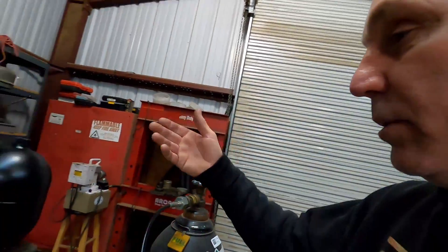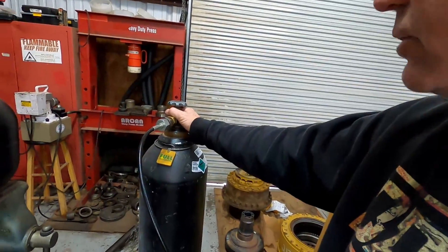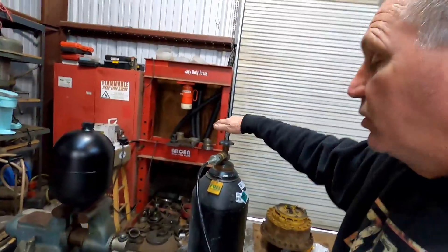Use all safety precautions. If you aren't familiar with this, get properly trained — don't consider this video as training. This is just showing how I do it. For those familiar with nitrogen charging, it should give you the pressure spec and an idea of the process — they're pretty simple to do. Always wear eye protection. The nitrogen bottle should be secured with a chain to a post or vise — if it falls over and the valve breaks off it becomes a literal rocket. Thanks for watching, please hit like, share, and subscribe.